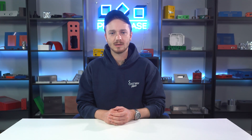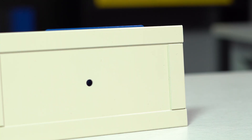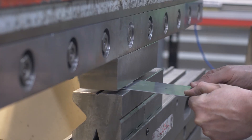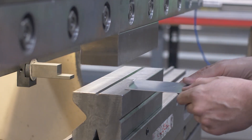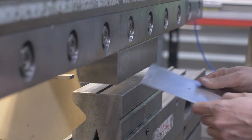Next, we have hem bends. A hem bend is an edge of a sheet metal part that is bent to 180 degrees and flattened on top of itself. Hem bends add another layer of rigidity to an edge of a part, which is especially useful in long sections of a sheet metal part that could be unstable. Hem bends are created on a press brake, with a large die bending the material as far as possible in order to create an overbend, then the bend is flattened with a flattening die.